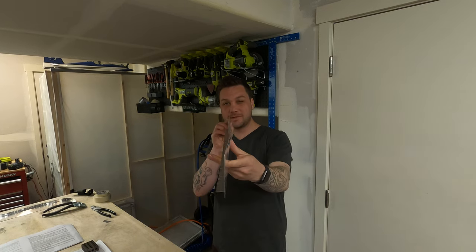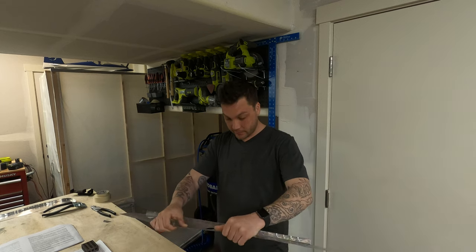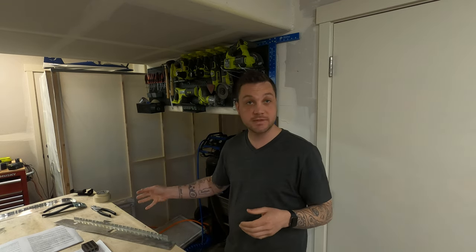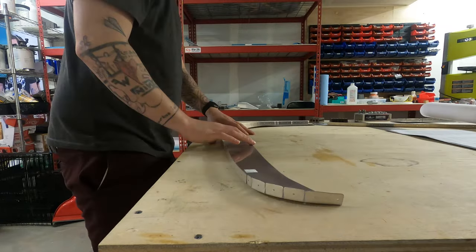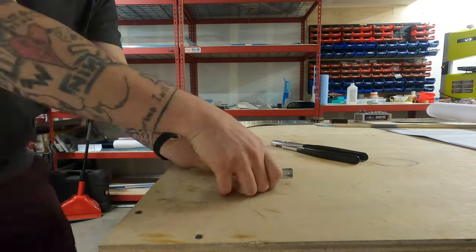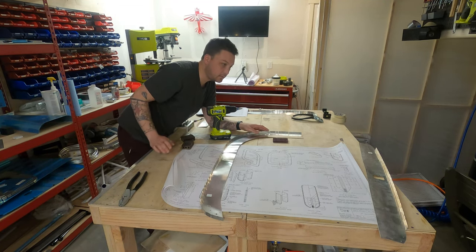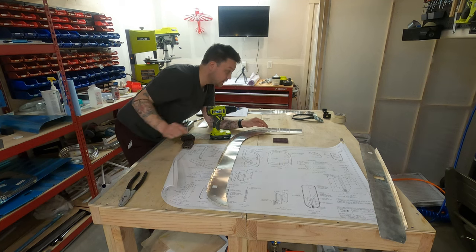What's not good is how flat they're laying, so this will need to be fluted. I'm trying with some of these pieces, but as you can see there is a significant amount of warping, and I don't know if my little puckering of the edge is going to be able to do much for that. I'm hoping that once we get some stiffeners on this it straightens out. The side pieces of the bulkhead are definitely laying flatter, and I think once we join all three of these, hopefully there's some strength in the three of them completing a circle. The jury's out on whether I made the problem better or worse — we still have some wavy bacon action on these pieces, but I'm hoping that resolves itself as we get these structures tied together. Overall they're pretty flat from one end to the other, and that I'm happy with.